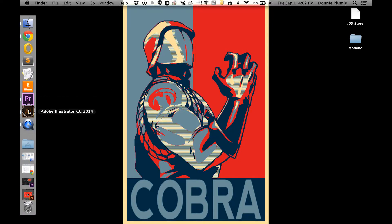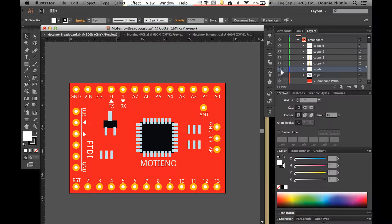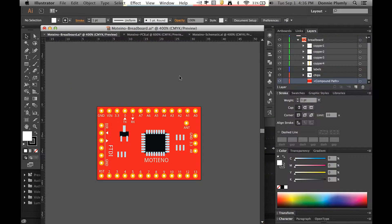The first view is the breadboard view. Over here we have groups and layers. The structure is: a first layer that contains everything, then a layer that just says breadboard. Inside that are the copper pieces — connector pad one, connector pad two. The next group is the label group, so you know what you're hooking wires into. Next are the chips — you don't really need them but they make it look like a board, so I'd recommend putting them on. The last layer is just the color of the breadboard.